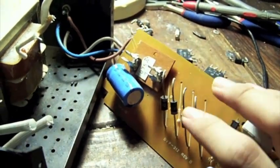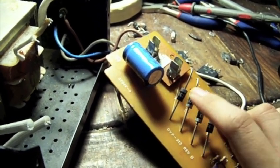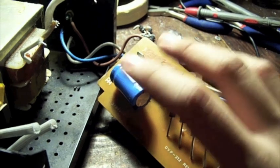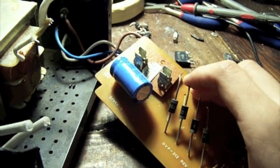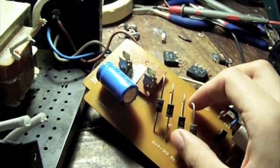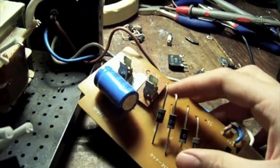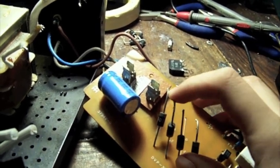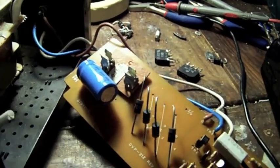After that I knew that this was a classic bad rectifier problem, which is a very common problem with power supplies — not just this one, but many different types. Blowing fuses constantly is a classic telltale sign of bad rectifiers. So I went ahead and disconnected one side of each rectifier and tested them with the diode checker. Sure enough, these two here are conducting both ways, which is obviously not what they're supposed to be doing, and they need to be replaced. So I'm going to go ahead and replace those, and that should fix the problem.